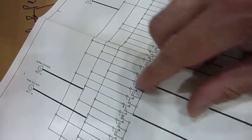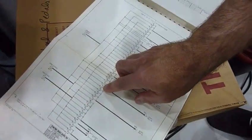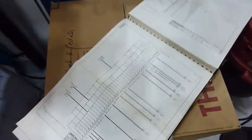Bale 4 is tied to numeric, so I have to check that contact — that would be the only one that can cause the 5 to be punched when numeric voltage is applied. So hunting for contact Bale 4.